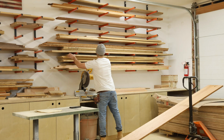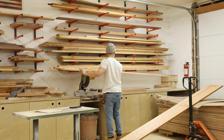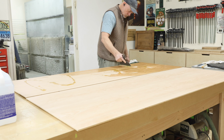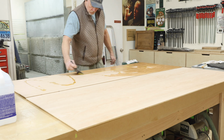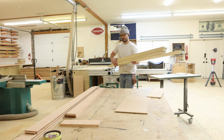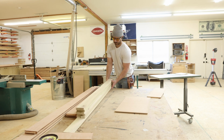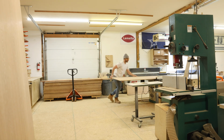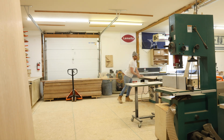And then I moved over to pull out some poplar for the actual bed frame, which doesn't need to be Cherry because you're never going to see it. And while I was doing that, Rowdy was getting a coat of Rubio on the panels before we glued them up in the frame. And I am a big fan of Rubio. I really like using that stuff. And so there's my poplar parts. Wasn't going to show you the whole milling process again. It's basically in your cut list, all these parts, and that will make up the bed frame.